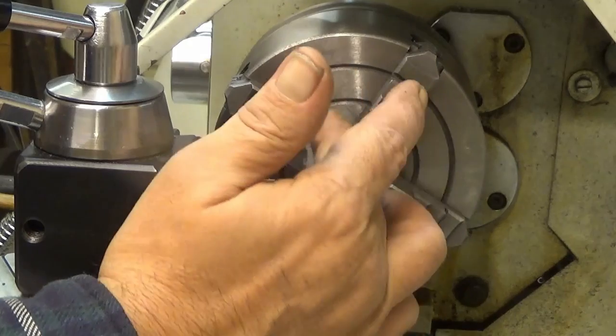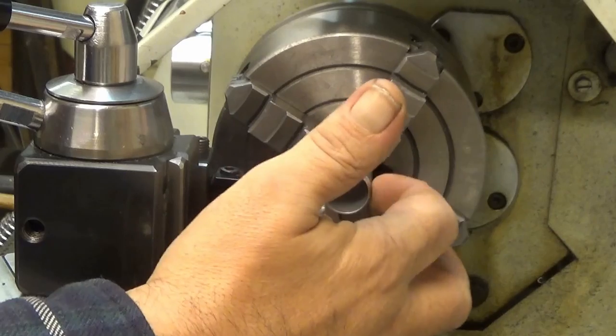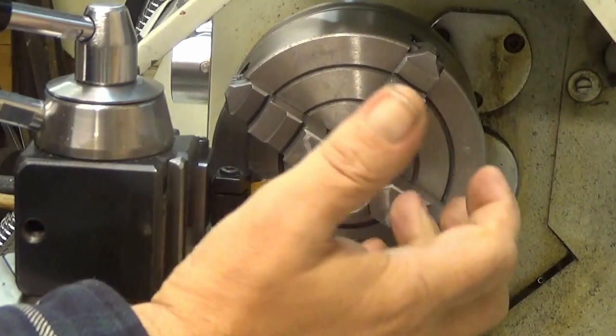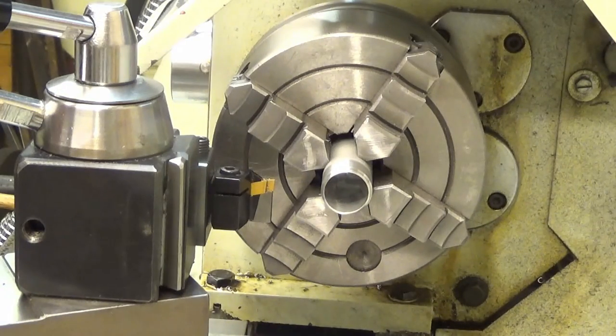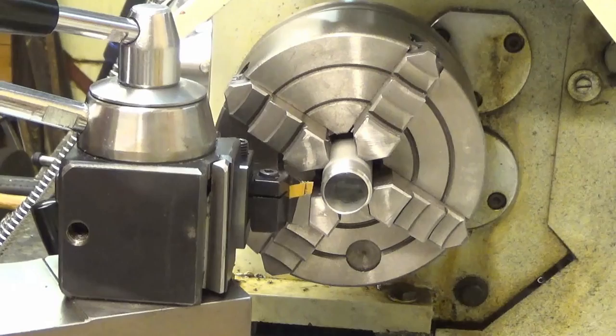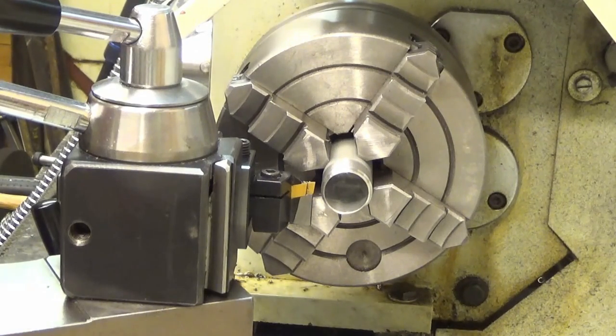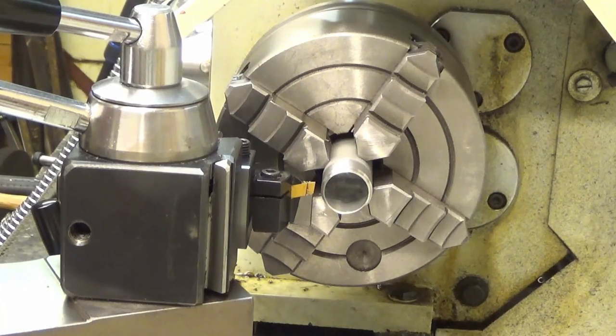And then I used some emery to get rid of the anodization, because this is going to be glued into a steel piece. And now I have also made this so that this is now 10 millimeters. It will be total length 10 millimeters. And this will be a parting process, which is really, if this fails, then I will need to think of another approach for this one.